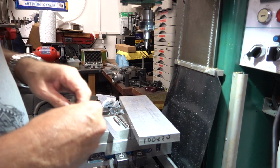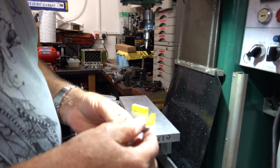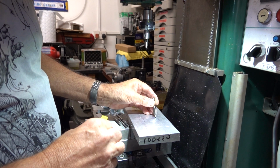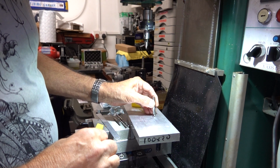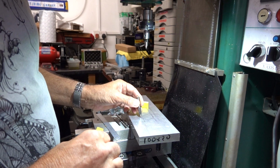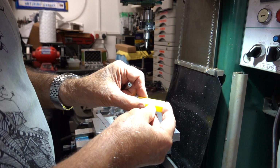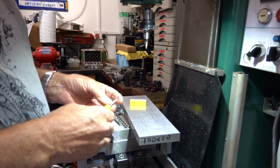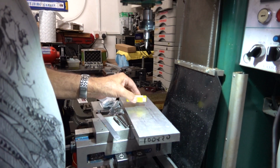2 days. So we'll look at the one we're going to use. Yep. That's tight. So I'm not going to go in there. So I'm going to struggle. Yeah, it's showing it as 5.2, 8.9. I'm going to have to open these holes all up to 5.2, or as near as I can. I don't think I'll have a 5.2, I might have an Imperial.